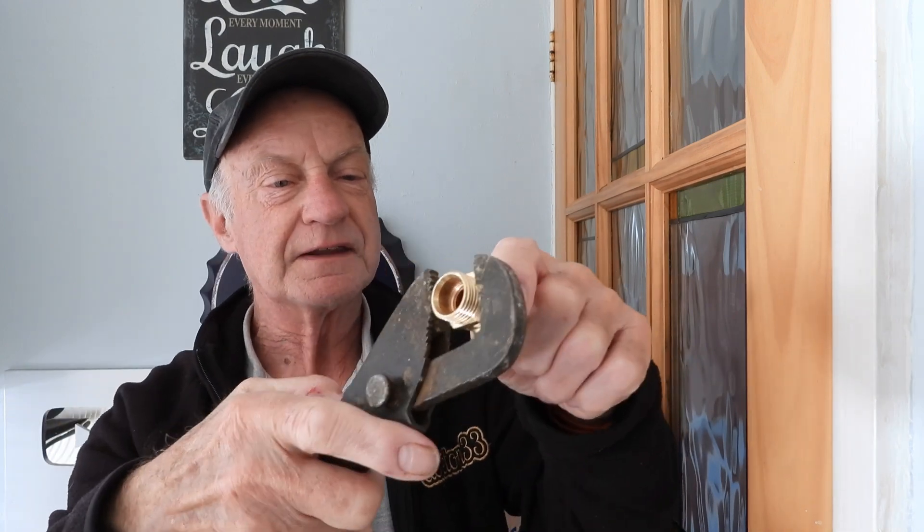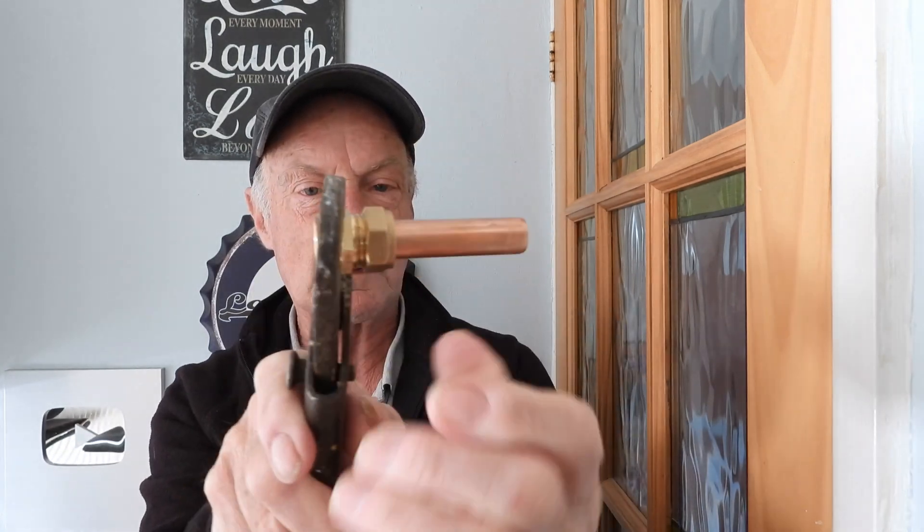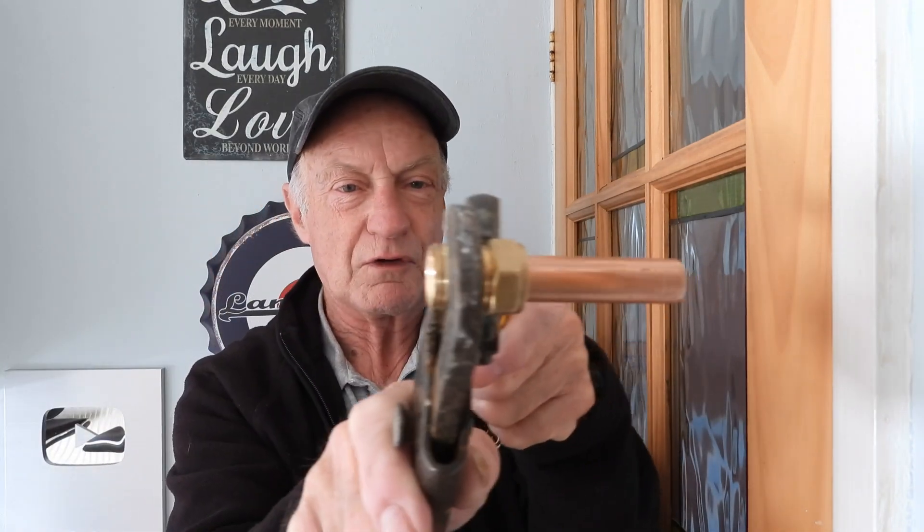We also have my tried and trusted footprints, which I always like — they go on there like so, and leave enough room for the thread to go up, spanner along there and down like this. Lastly, I use quite a lot these nice little thin grips, which are going to be handy in a minute. Once again, you clamp that over the nut part — don't ever put it on the threaded part, you don't want to ruin the thread — and then once again spanner on here and tighten it up.